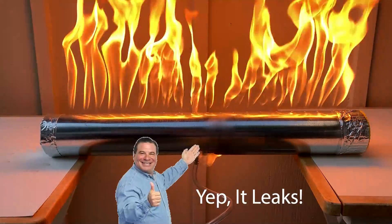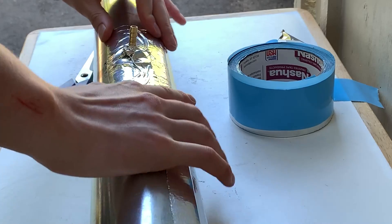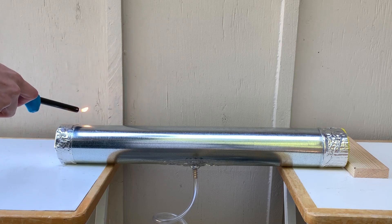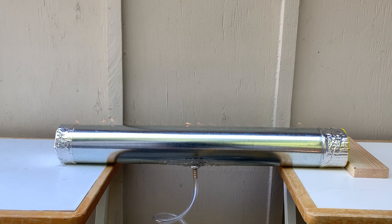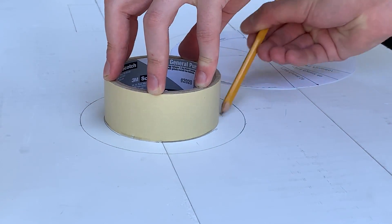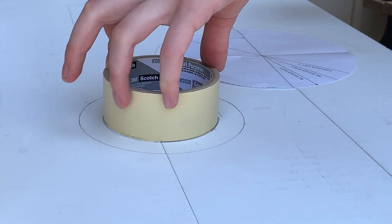Initial testing did not go as planned. I went back to Home Depot, got some large flat washers, bent them to the curve of the tube, and resealed everything with aluminum tape. After that, everything seemed to work fine. When I tested it with music though, the taped-up end was absorbing too many vibrations, so I wasn't getting much of an effect. I'll need to find something solid to replace that end. For now, it's time to start cutting the holes for the speakers and the control boards.